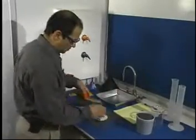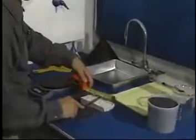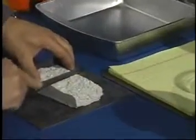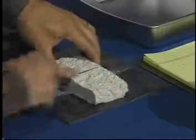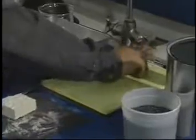Displacement method for density. Carefully remove a sample having a minimum size of 8 cubic inches by cutting to the substrate and prying the material from the steel. The sample shall be cut to a uniform size, removing all uneven edges. Cure the sample as previously explained in the calculated volume method section. Weigh the sample and record the weight.